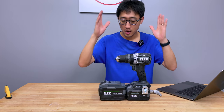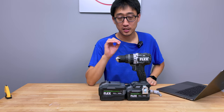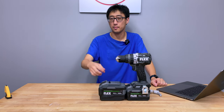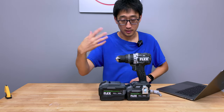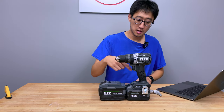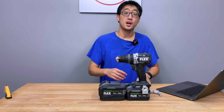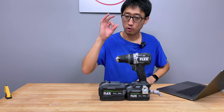Just in case you didn't know, a couple months ago DeWalt and Flex both released stacked lithium pouch cell battery packs for their platforms. DeWalt on their 20-volt max platform released 1.7 amp hour packs called Power Stack batteries. On Flex, they released for their 24-volt platform — I believe like 3.5 amp hour — but what we have here today are 6 and 10 amp hour stacked lithium packs. The difference here really is that most power tool batteries on the market right now use cylindrical cells.